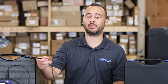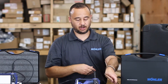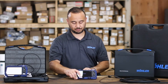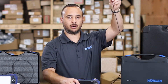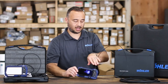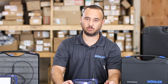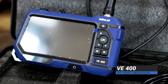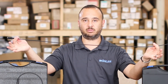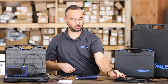This does record with audio and plays back with audio as well. There are two cables that come as accessories for the VE400. The one here is the one meter, three foot cable that has two cameras on it. We simply unscrew the cannon plug and pull up. Now we can put in the small 3.3 millimeter camera that has the same definition quality for recording and display — this one does not have two cameras, but it has the ability to flex itself into shape for many different small cavities or compartments that most cameras with a large diameter would not be able to access. We also have a 9.8 foot, 3 meter version of the same exact cable, as well as a 9.8, 3 meter version of the original two-camera head cable.